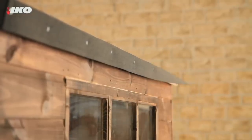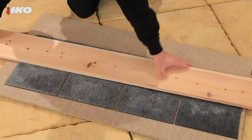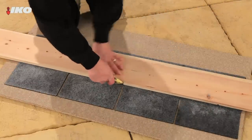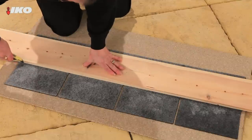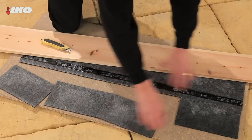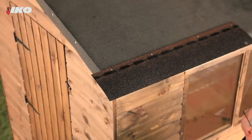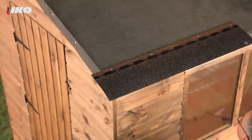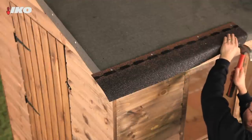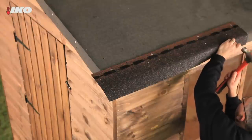Next, you need to make the shingle strips for the roof edges. Cut off the tabs from a single shingle strip to create the detailing pieces. A tip when cutting shingle strips is to cut from the back, as this should enable the membrane to fold and separate easily, and it will also avoid damaging the knife. These shingle strips should be positioned extending 50mm beyond the edge of the roof and then nailed at 50mm centres. Take care when folding these edge pieces and in cold conditions you may need to warm the material first to make it more pliable.